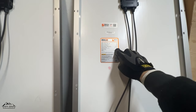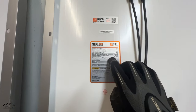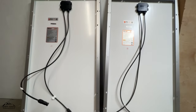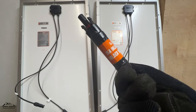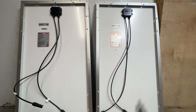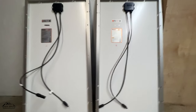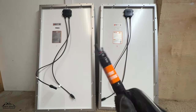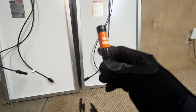This panel can handle 10 amps going through it before something could go wrong, so you want to set up fuses to make sure that 10 amps don't go through it. You're going to want to use a fuse that matches the maximum series fuse rating — so 10 amps means a 10-amp fuse. I only have 15-amp fuses for this video because I thought these panels were still rated at 15 amps, but they changed, so let's just pretend this is a 10-amp fuse.